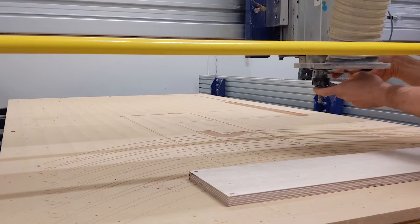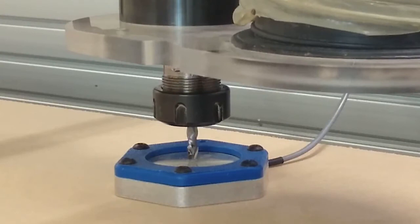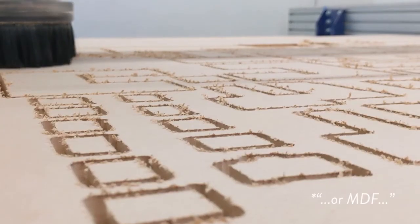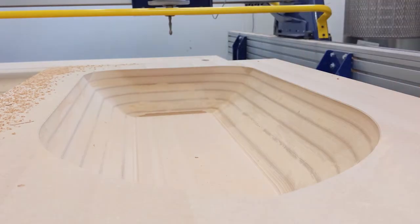Tighten everything down — you want the bit as tight as possible to prevent it from sliding down during operation, but don't tighten so much that you risk stripping threads. Place the Z plate under your bit and in the software select 'Zero Z Axis with Z Zero Plate.' The spindle will lower until an electrical circuit is made between the bit and the plate, lower a second time, then confirm when done. Put the plate back in its holster. Zeroing to the spoilboard is standard, but you can alternatively zero to the top surface of your stock material — the most important thing is that your origin on the ShopBot matches the origin in your manufacturing setup in Fusion.